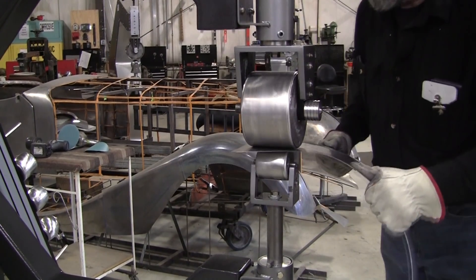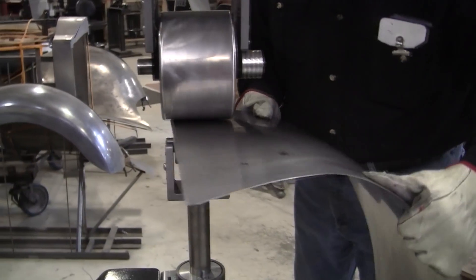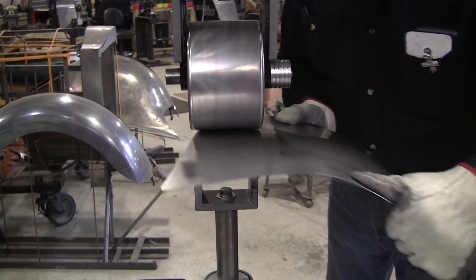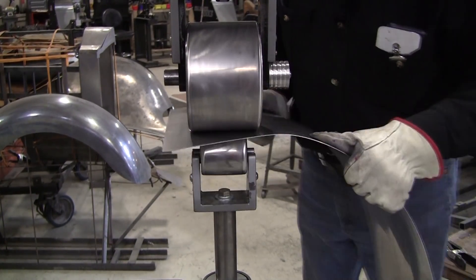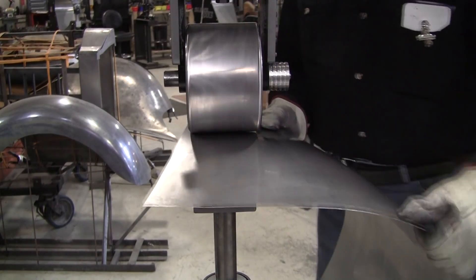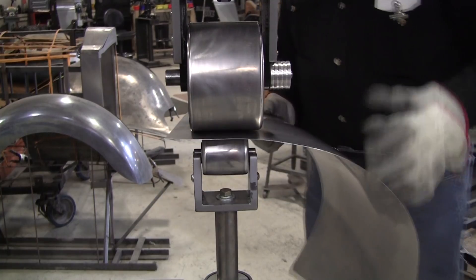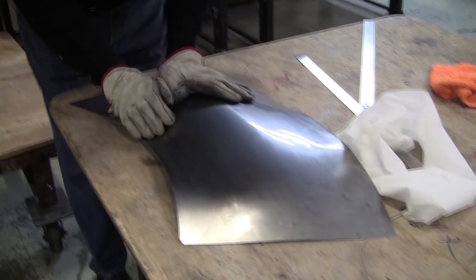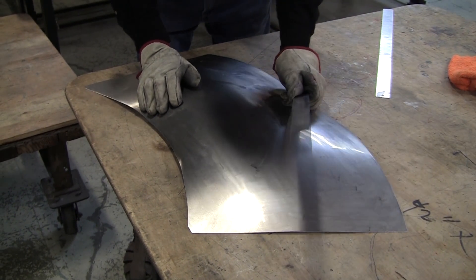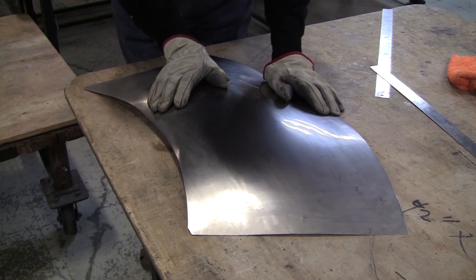So we haven't been giving any attention to the ends of the panel, so I'm going to give the ends just a little bit of attention here so I don't get a sharp difference in the surface flow. I'll bring it over to this end and do this here. Now that was a few more minutes. Let's see where we're at. There's my low crown wheel, and obviously that's not really a low crown panel anymore. Now I'm probably two inches or better in crown on that panel.